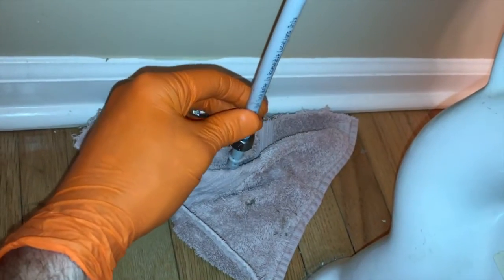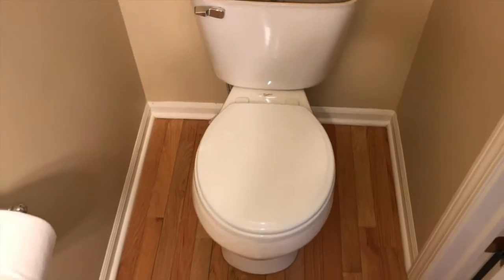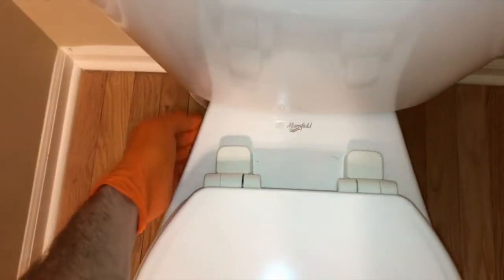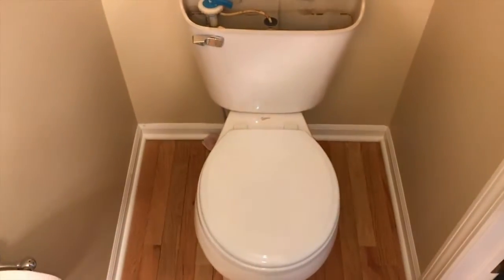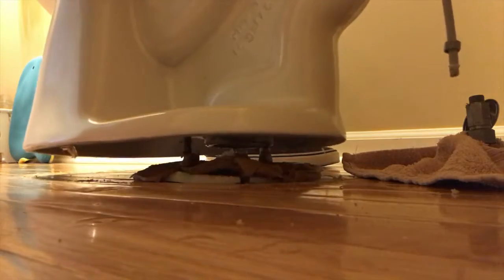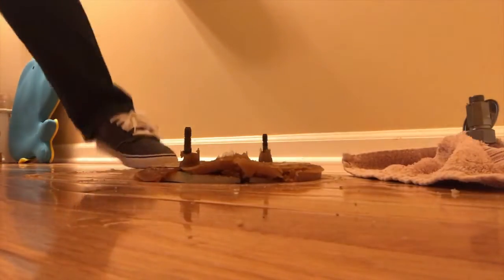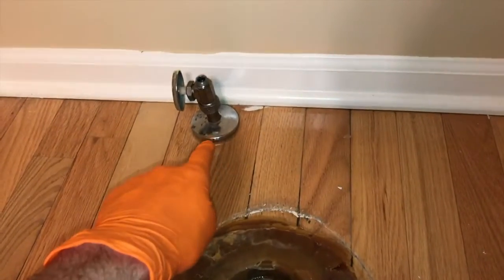It's not draining a lot because we did our best to remove all water from the internal portion of the tank. Now the fun part — we are going to put one leg on each side, left hand under here, right hand under here, and carefully teeter-totter to pull the toilet up and off the threaded studs below and remove the toilet altogether from the bathroom.